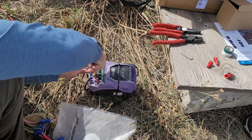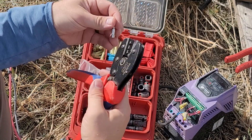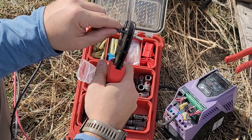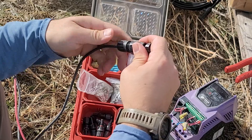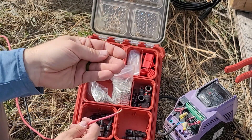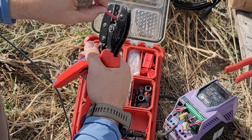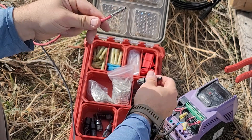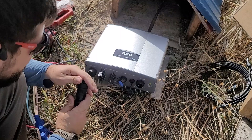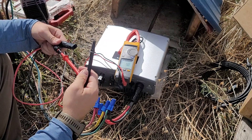I need to add MC4 connectors onto the solar cables to get them connected, because originally on the purple inverter it was just a direct wire with no connector, but on the new inverter it has MC4 connectors built onto it. I just bought this equipment off Amazon — very easy to do. The simplest way is to put the metal connector into the crimper tool, slide the wire in, and crimp it down into place. Anybody can do this. The termination just slides right over the end, and tightening it down makes it watertight. I followed the instructions from RPS that shipped with this inverter on how to wire the AC input, and I brought 500 feet of 240-volt wire down from my cabin up to here.